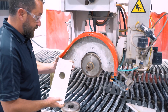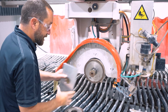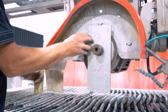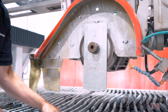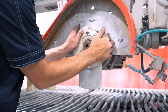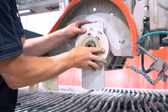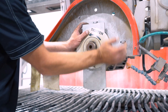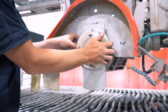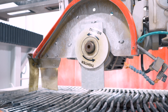We want to take our 15-inch diameter jig here that the machine came with. We'll slide our brass ring off. We're just going to slide our jig on until it touches the back flange. You're being pretty careful — I'm assuming those are some precision components that we don't want to scratch. That is correct. You don't want to get too aggressive. Sometimes you'll have to use your palm to tap them on; if it starts sliding on crooked it'll bind up, so pull it back off and straighten it out. Do not use any hammers or steel mallets on it at all.